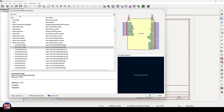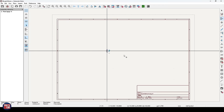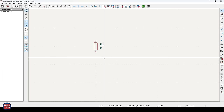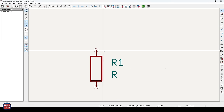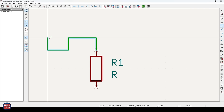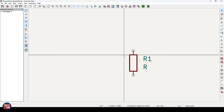You can also use the filter at the top — type R and it jumps to the resistor, double click and place it. Right click or press Escape to cancel. The little circle node indicates a pin is not connected. Hover over a node and left click to draw a wire — click, click, click to draw an arbitrary shape, then double click to finish or Escape to cancel. Use Ctrl+Z to undo. Press A on the keyboard for the add symbol shortcut, then type C for capacitor and place it. To copy, use Ctrl+C then Ctrl+V.